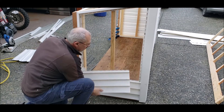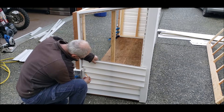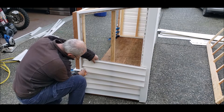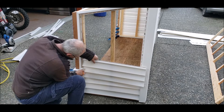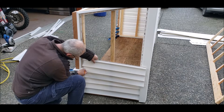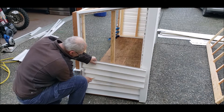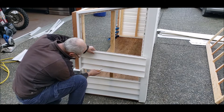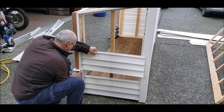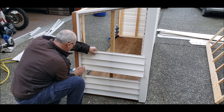We've got our 29 and a half inch piece now. I'm going to stick this right up inside there — this will give me the spot where I need to cut out to. I'm going to go with a bit of expansion room and come in about a quarter of an inch higher than that, and then I'm going to need to cut the bottom out. Slide this in, pull it back about a quarter of an inch, and line that up with the inside of this piece with some expansion room.